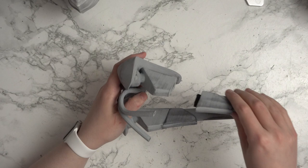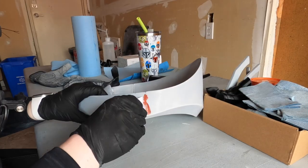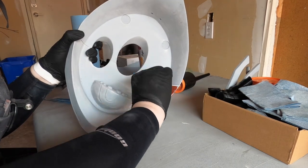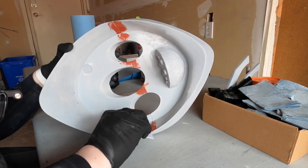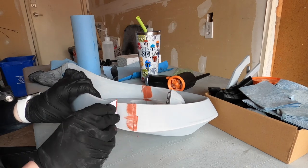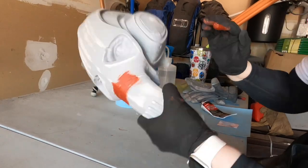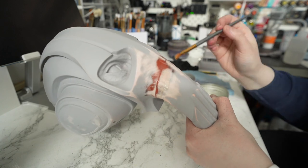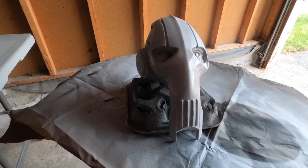At this point I was also assembling some of the smaller pieces because I knew I was going to have to do a lot of work on the seams, getting those nice and smoothed out and blended. Once the glue had dried enough I decided to bust out the spot putty for some of the larger pieces because it sands so beautifully, though I used wood filler on some others. The head still had quite a distinct line even after multiple passes of spot putty and filler primer.